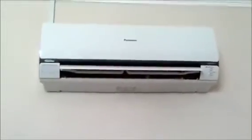This is the outdoor unit — I have four here. They're exposed to the ambient and don't collect much dust. If yours is collecting dust, get a water hose and flush it here. Make sure you don't get water into the unit where the motor is. You also want to flush the front part — you can see the fan has dust on its leading edge. Flush it with a jet of water until completely clean, and also flush here if there's a lot of dust.